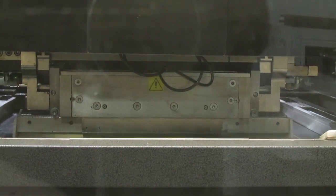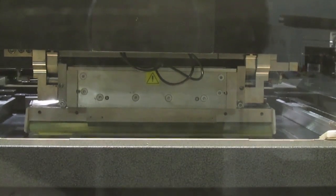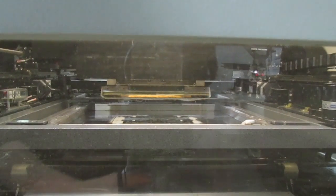To get started, we use the stencil and a stencil printer to put a layer of solder paste on the metal of the printed circuit board. The solder paste is tiny beads of metal solder in a tacky, mildly corrosive flux that adheres to the metal and removes any oxidation.